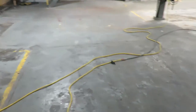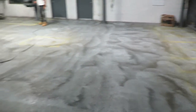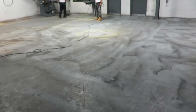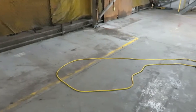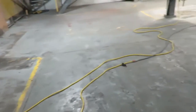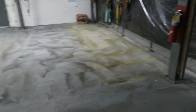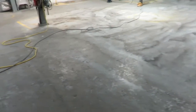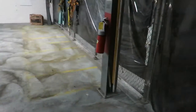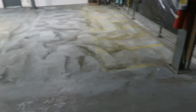I'm a firm believer in applying a protective industrial-strength clear coat over all epoxy floors. But in this case, they don't want to — they don't want to take any chances of anybody slipping and falling. Even when you use a non-skid additive to these products, there's a bunch of guys working in here. If somebody spills a Coke or water on the floor, it still becomes slippery enough where someone could fall and hurt themselves.